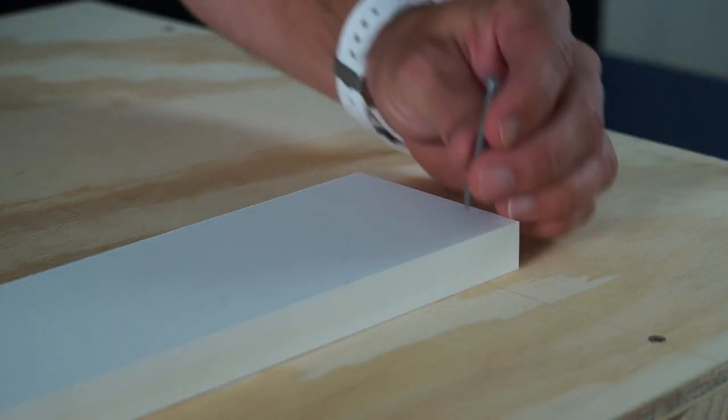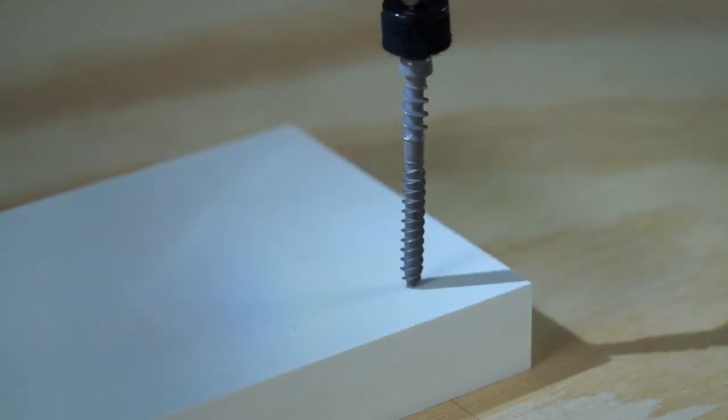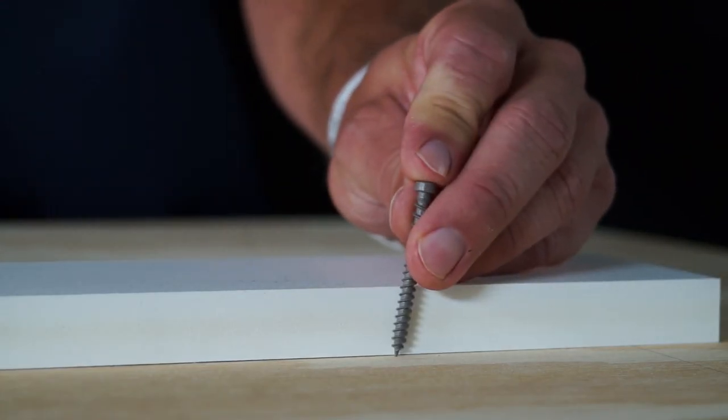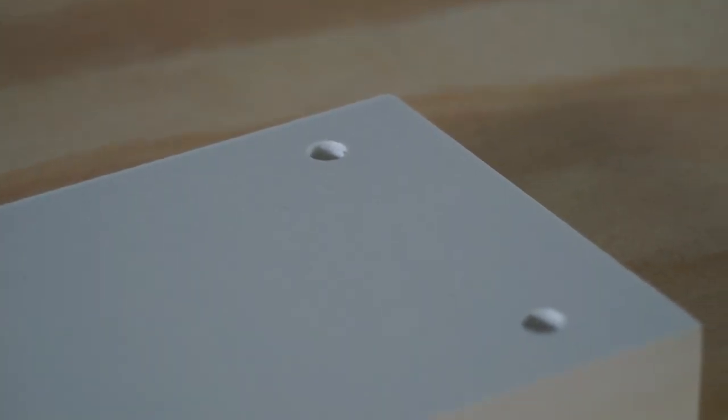First, using the supplied Cortex bit, drive the fastener at a 90-degree angle to the preset level below the trim surface. Be sure to use a fastener long enough to penetrate the solid wood substrate at a minimum of one and a half inches. Use two fasteners per every framing member for trim board applications, ensuring not to fasten more than two inches from the end of the board.